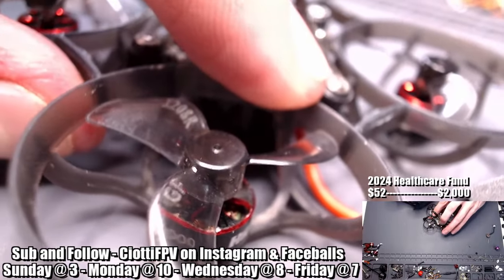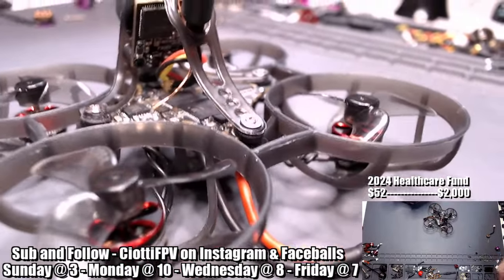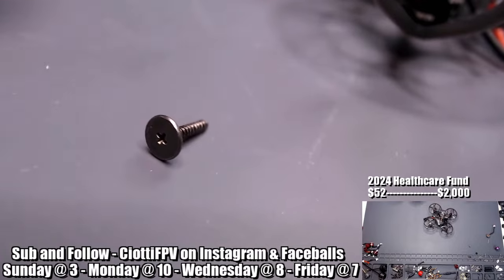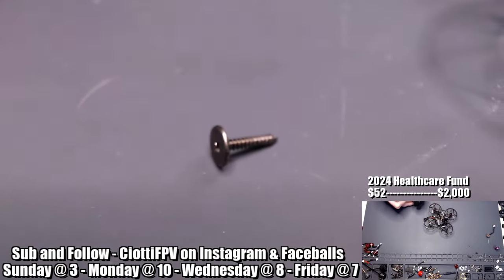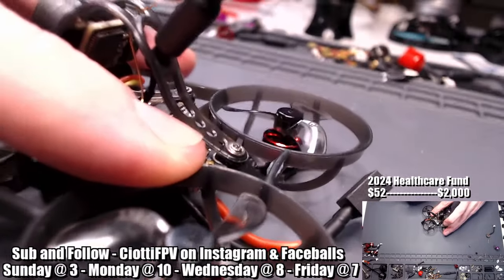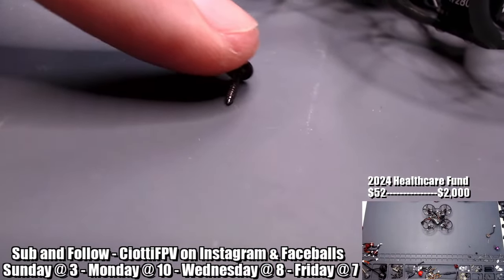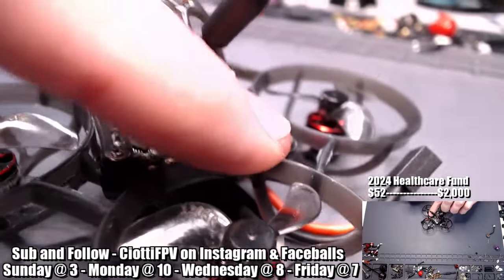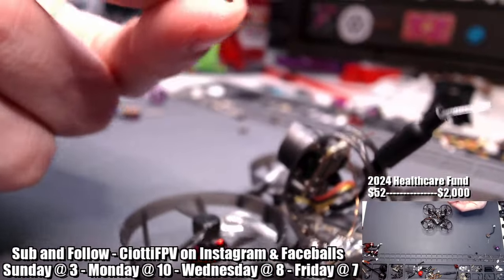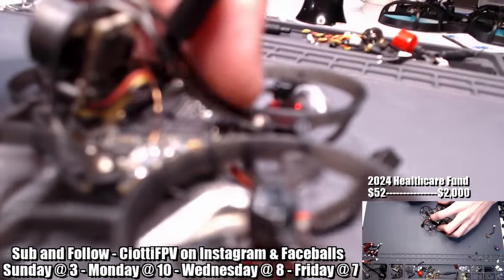If that ends up being a weak point, what you can do is run a longer screw there. HappyModel has these Mobula6 screws that are significantly longer. And so if you ever have an issue on a tiny whoop breaking those posts off of the frame, all you got to do is get yourself a set of these longer screws and put those into that rear mounting point, and it makes a massive difference. I've had to do that a couple of times, and once I've run these longer screws, I've never had that issue again. So just a little bit of food for thought.